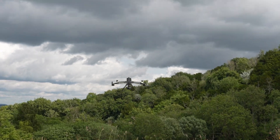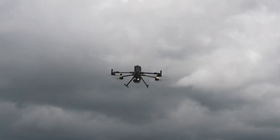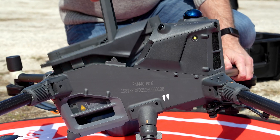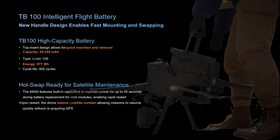These new smart features also include a ship-based takeoff and landing capability. The Matrice 400 has just one battery this time; however, with the extra space that gives, plus smart battery developments, you gain a capacity of just over 20,000mAh via a 13S battery with a 400-cycle life. The new top-load battery is quick and smooth, with hot swaps still possible within 45 seconds, thanks to an onboard small battery within the drone itself.